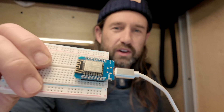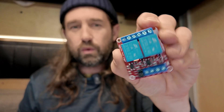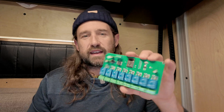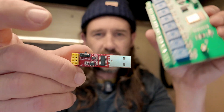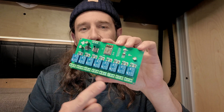It might not be so exciting to just turn the onboard LED off and on, but it really helps lay the groundwork of where we can go from here. What if we want to control something like this — a large motor controller that could drive a linear actuator or high-powered LEDs? Or maybe we want to control a couple of relays for our water pump. We can take a device like this, use the GPIO to drive these relays, then we have switches for those relays inside Home Assistant. Suddenly we've built our own device that can control special things in the van. The next step would be to add automation so you could have logic or one device control another. You can also find boards like these — eight relays on a development board that already has an ESP8266 microprocessor on it. The only downside is there's no USB, so you need a USB UART programmer to connect for the first time. After that, all updates are done over the air via Wi-Fi. We have one like this under our water bench to control all the valves and water pumps in the van.